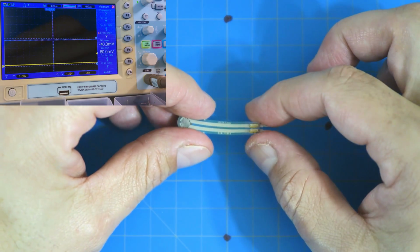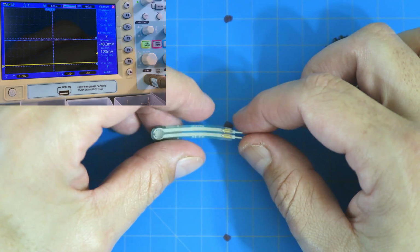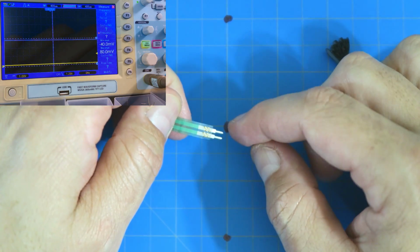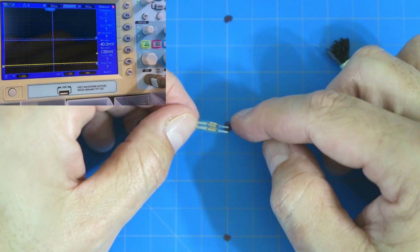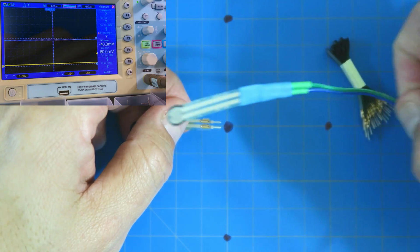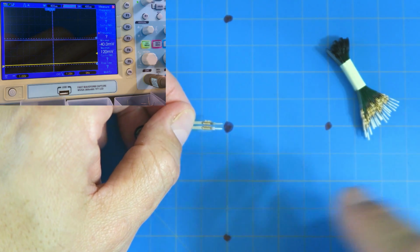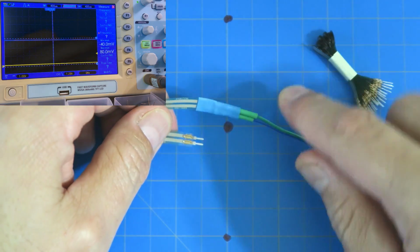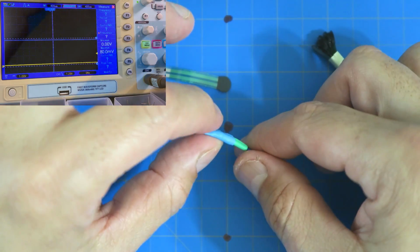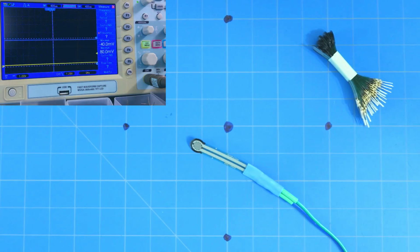The whole idea is that when you make your cable for this, you're going to mechanically connect onto these 2 things, because if you try to solder, I guarantee this thing will melt. What you can do is mechanically connect onto both with a couple of little clips with wires on them, and that's what I did here. Then I did some quick soldering, individually wrapped them in heat shrink, and then the whole thing in heat shrink. That's pretty strong in there.